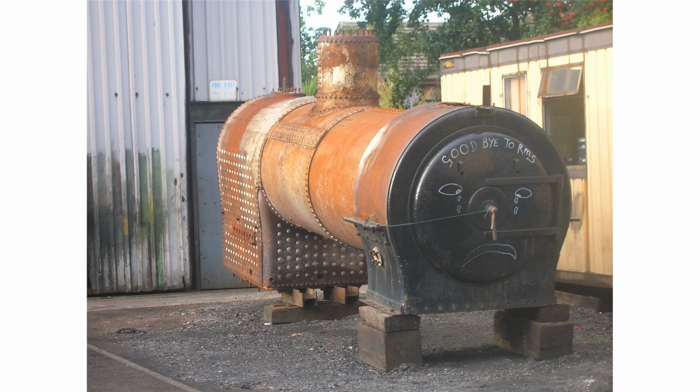As locomotives grew in power, their boilers expanded in diameter, but the width of the firebox grate was still constrained by the need to fit between the locomotive frames, which were themselves constrained by the gauge between the wheels. This led to the development of the waisted form, where a narrow firebox flared upwards and outwards to meet the boiler barrel. Staying of these firebox side walls could still use simple short rod stays, although these were progressively tilted in the middle of the firebox, so as to remain perpendicular to the sheets.